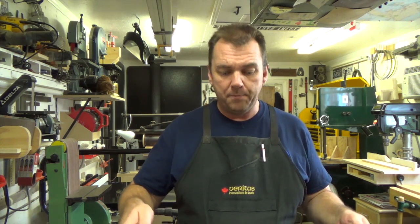So anything that I relay here is either from personal experience as I learn along with this project, or from things that I've researched. From what I understand, the important part here is to keep constant pressure on that board while letting the steam from the hot pipe evaporating that water penetrate and loosen the fibers of the wood, and eventually the wood will give and allow you to bend it.